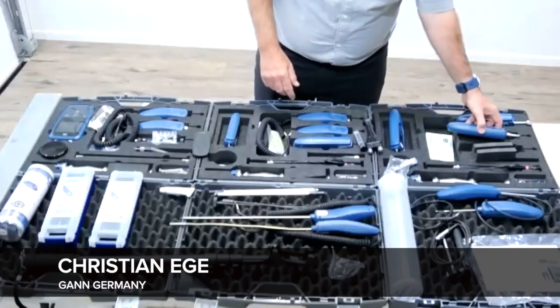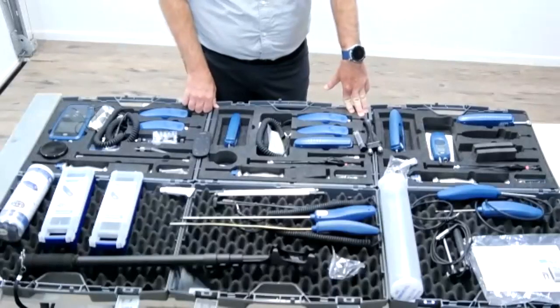What you can measure with this is relative humidity, temperature, and you can also measure infrared surface temperatures, which is important if you have to assess dew point, if there's mold, if you need to check whether the moisture problem is perhaps a problem of humidity and temperature, meaning that there's too much humidity in the room. The temperature might be too low. You've got critical walls, critical corners, something like that, where mold can occur or has already occurred.